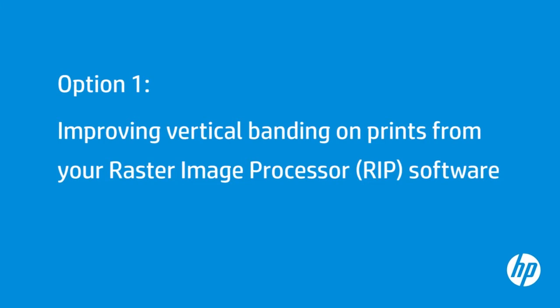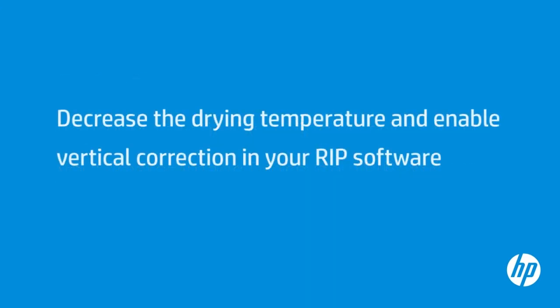Adjusting the media profile in your RIP software can help resolve vertical banding issues. For this demonstration, we will use Onyx Production House X10 software. Decreasing the temperature and enabling vertical correction in the RIP can resolve vertical banding.